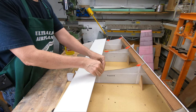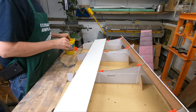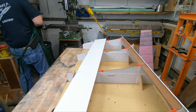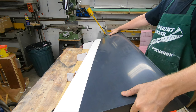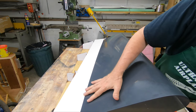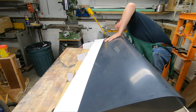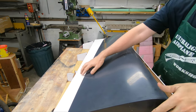I noticed when I tried test fitting the rudder plug on this cradle that it did not want to stay up — it makes sense because it's inclined, with the nose pretty high relative to the trailing edge. I thought, let's try some play-doh. I put play-doh at the front and rear of each one of these ribs, thinking it would help cradle the plug and maybe be sticky enough to hold the rudder in place. But it was not sticky enough — it just slid right down. That mold release on the plug works really well.